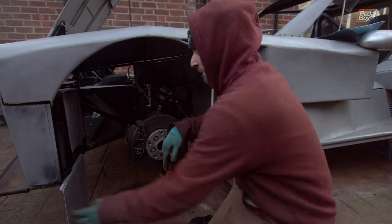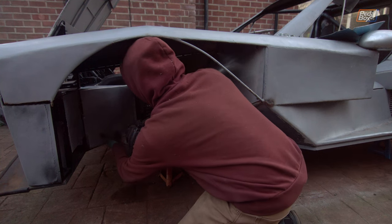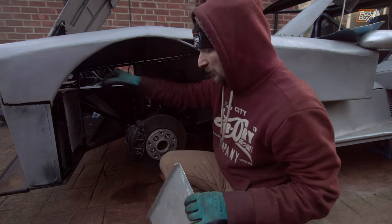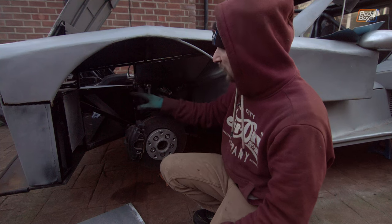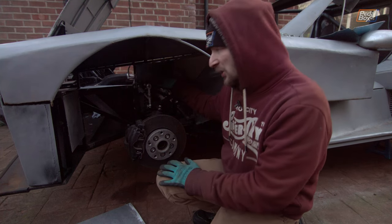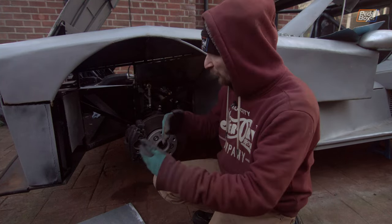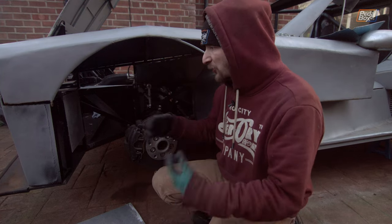We're going to simplify things and start somewhere else, building up in small pieces. We've got much larger pieces of aluminium prepared — one goes in the front inner corner, then a flat triangular plate goes on top to cover that, leaving just two triangles to fill in, which should be a lot easier. Part of the problem is there are three different parts of the car meeting here: the top of the arch and the frame which are part of the chassis, the radiator bracket frame in the middle, and some stuff at the front that's part of the bumper assembly that all comes off. This approach gives us a more secure way of attaching everything with more faces, angles, and triangulation to support itself without being riveted into parts we're not allowed to rivet into.